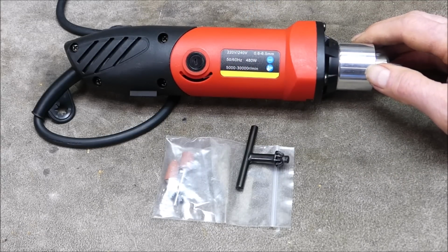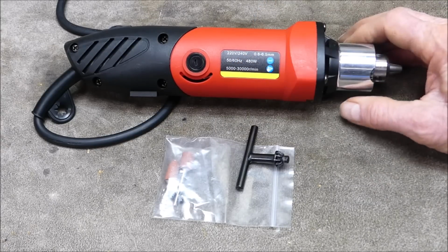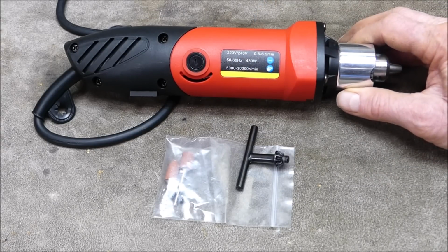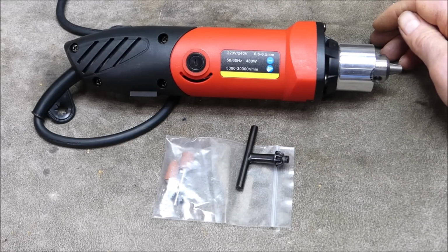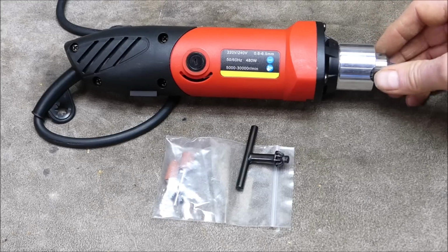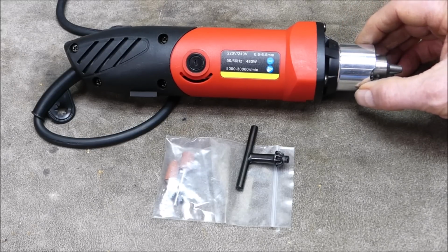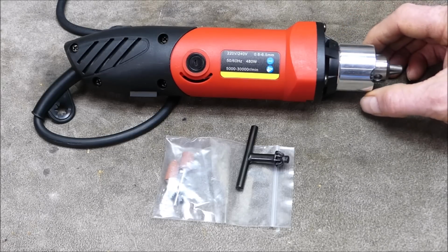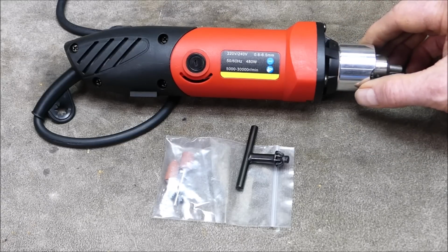They're just going to burn up the drills, and even that speed is way too high, 5,000 for drilling steel, way too high. It's even on the high side for wood. So yeah, these are meant for grinding, but this one is meant for mounting, and this is something the Hilda wasn't really designed for originally. It's just hand holding, but this one is purposely built.